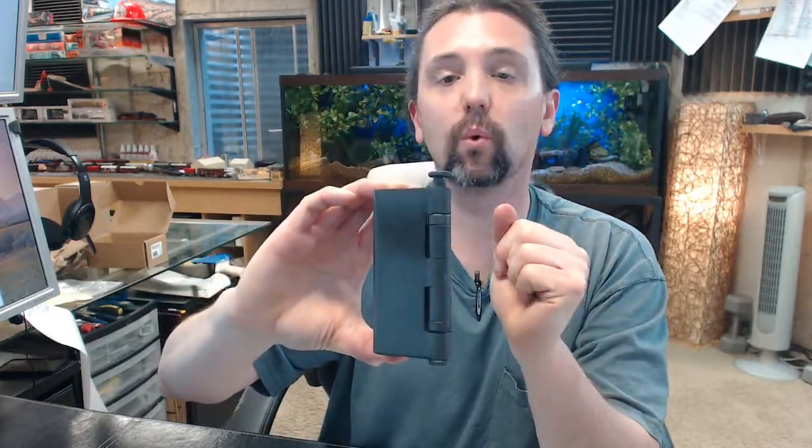First of all, this is a Swing Clear Hinge, and that very well might make this already known to you. If not, here is what a Swing Clear Hinge is: it is the type of hinge that when the door opens to 90 degrees, the hinge is completely removed out of the visible, or clear, opening width of the doorway.